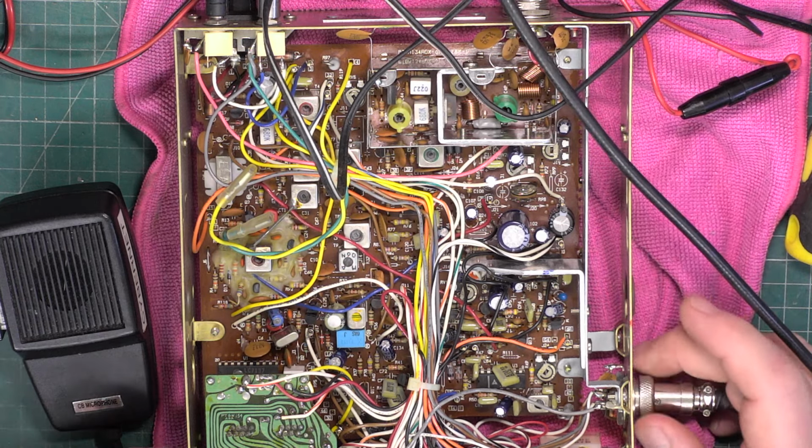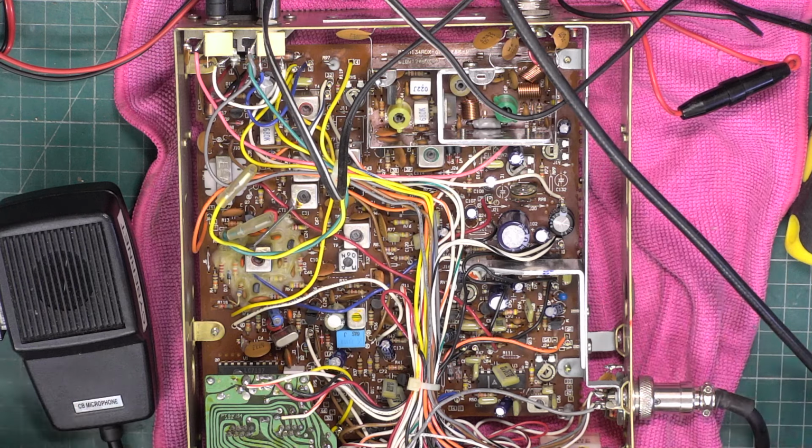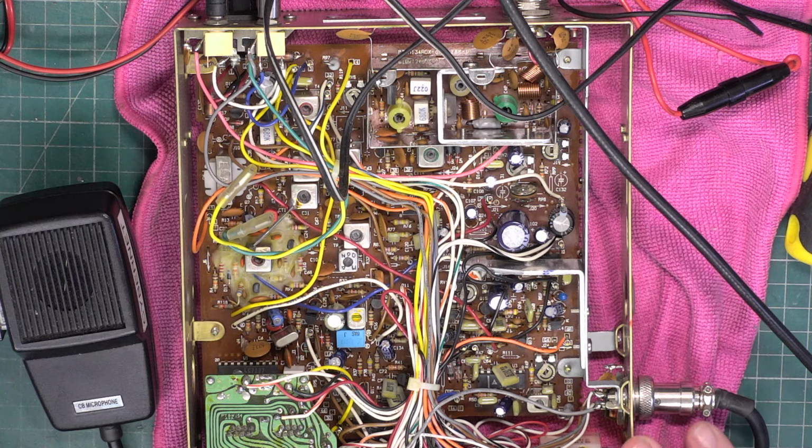But the fact it worked until I tested PA, I'm starting to think it's the CB/PA switch. The other day, I think it was the same customer, we did the Rotel 230, and when I went to test the tone switch, you got high low tone on those, like you got high, medium and low on these, there was no difference. So again, it was tarnished contacts on the switch, which is an interesting point. Let's see what the tone switch does on here. So we're at, see, that's fine. It's high low tone on these as well.